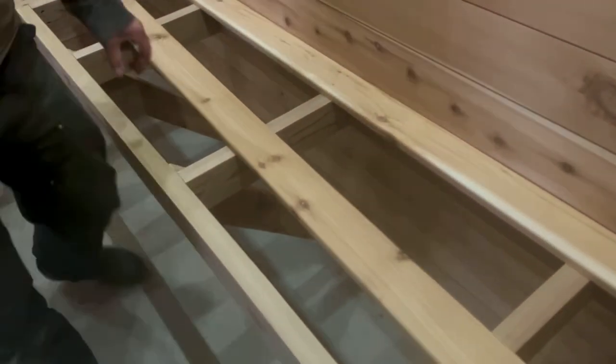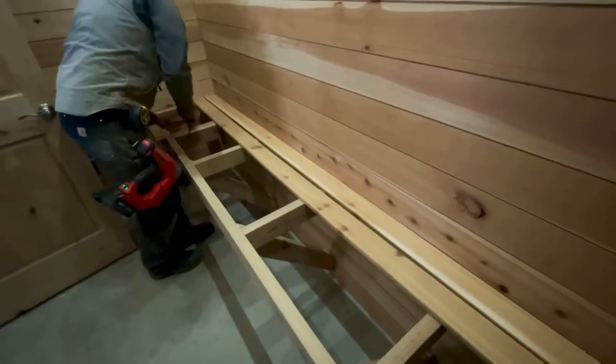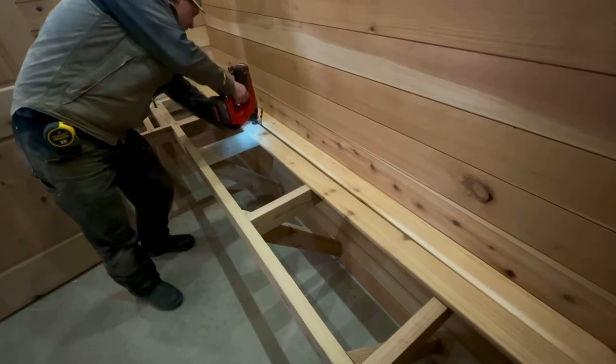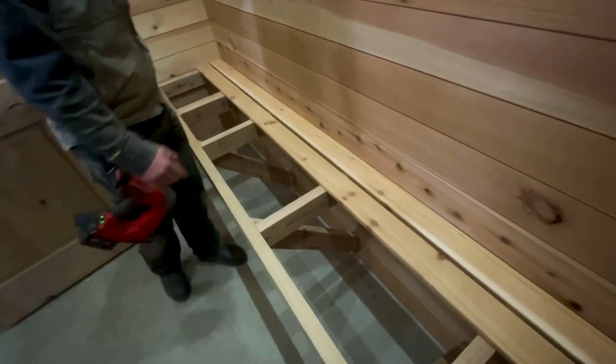So what tool gives you the bevel edge? A router. The one I'm using is just a trim router, so it's small, handheld, lightweight. Are you going to have them close? Just drop my spacer. Boards down and five more to go? Three more here on this side. And then down that side.